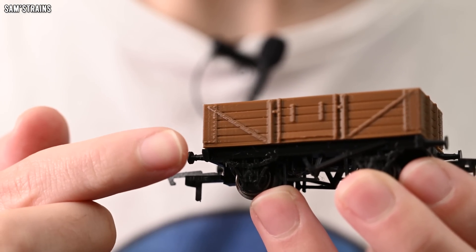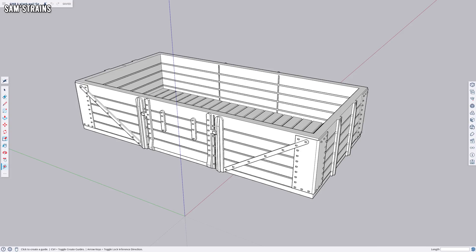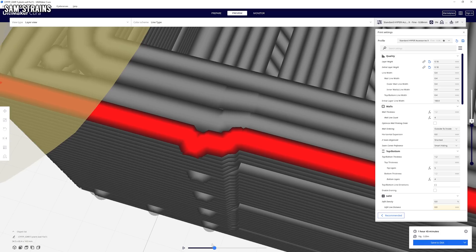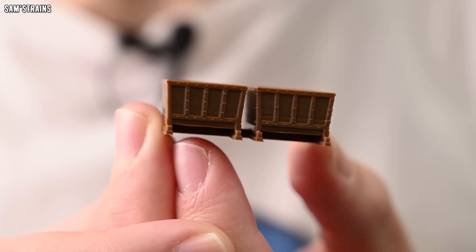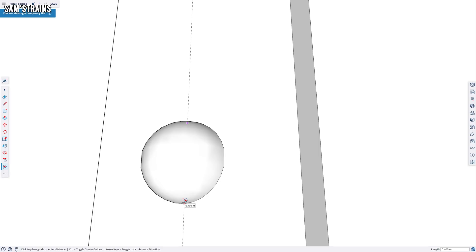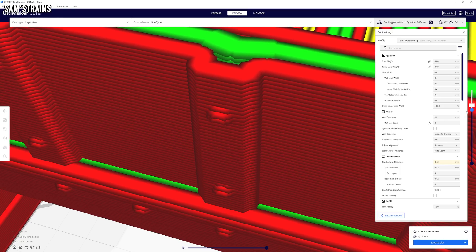For instance, this model here has very tiny rivets on the side. People said you couldn't get rivets with FDM, but of course you can — I achieved this by placing half cylinders onto my design. This model is designed to print at a layer height of 0.18 millimetres, and these rivets are exactly 0.18 millimetres tall so they only occupy one single layer. In the slicing software you can see that on these layers the nozzle just swings outward slightly, which creates the rivet. You can get even better rivets by using a smaller layer height: this model is designed to print at 0.08 millimetres, and the rivets here look even better. Each rivet is 0.4 millimetres tall, occupying five layers, and by making them dome-shaped I vary the amount the nozzle swings out on each layer, which produces a more rounded looking rivet.